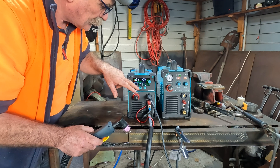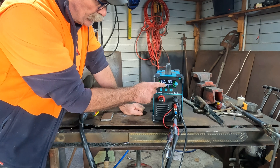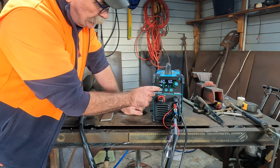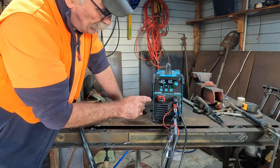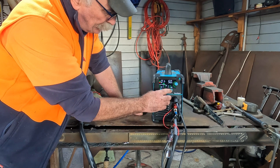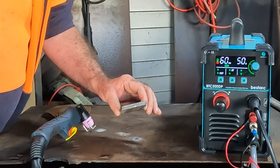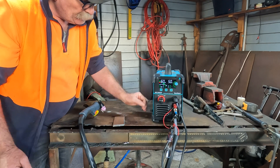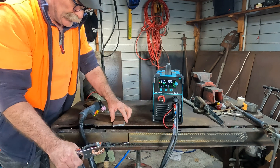Let's do some cutting and see what the baby can do. I'm going to have it on 2T so I can control the on/off switch, set to cut mode - not air, cut. We've got 60 PSI at 50 amps, post time at three seconds, and the PA at one second. First up we're going to try and cut a piece of 5mm steel plate. You'll notice the fan light has gone out because it's cooled itself off. Let's see if we can cut this.